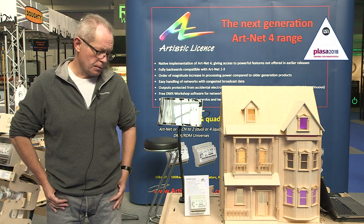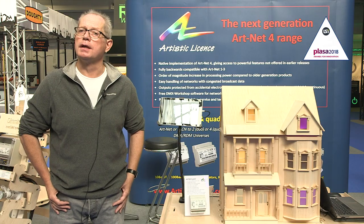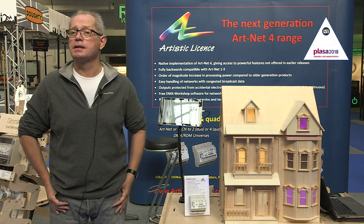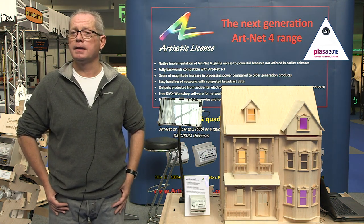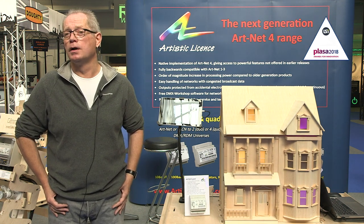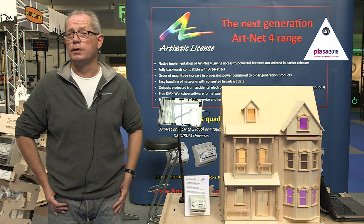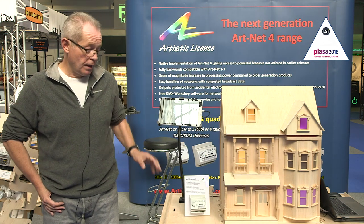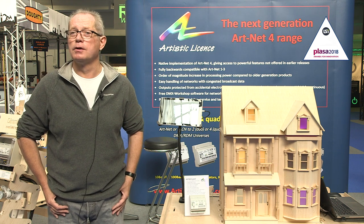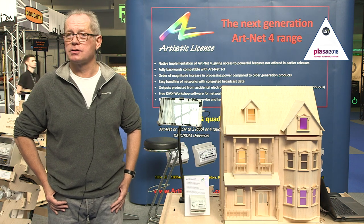The really great thing about this product is that it understands ArtNet, DMX, and RDM natively. So when you connect it to a production lighting board, the lighting board doesn't need to understand anything about DALI. You just plug it in and it can control DALI fixtures in exactly the same way it can control DMX fixtures. All of the feedback data available on DALI is within the product converted to RDM, so that also appears on screen on your production lighting board without the lighting board manufacturer having done any extra work.